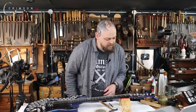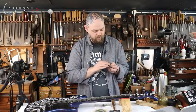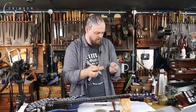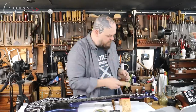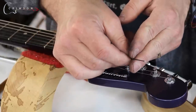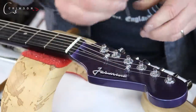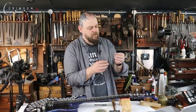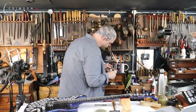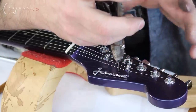Now I do need to do the eye, and we're going to do that quickly now. Yeah, this should do 0.05 of an inch. Okay, so that is now a slightly shiny Allen key on the end at least, and look at that. Looks like I've got a bit of a fiber optic in there or something. That's quite cool. So that's going to be my eye in there. I just need to chop that off. 1.25 millimeters, basically. I think 1.3 is around about what we need, don't you? Actually, 1.2. That's where I want that.